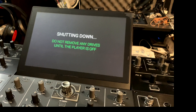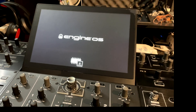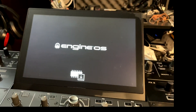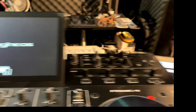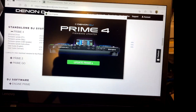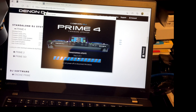It is shutting down and going into reboot mode — this one went a lot faster than the Go did. We are now in reboot mode. You'll get just one flashing light, and on the screen you have a little computer chip with an arrow on the bottom, which means it's ready to update. Now go back to the Prime 4 updater on the laptop — make sure everything is plugged in solid. We're plugged in from the laptop to the Prime 4 and ready to go. Hit 'Update Prime 4.'